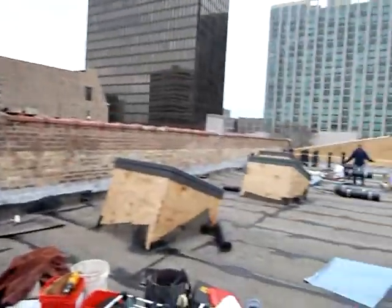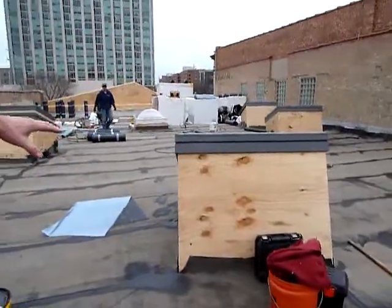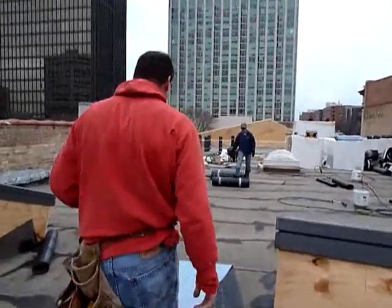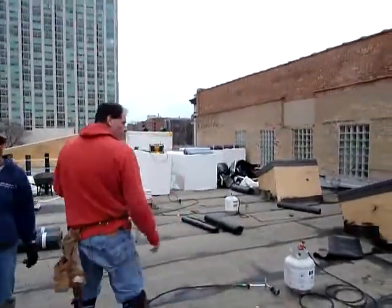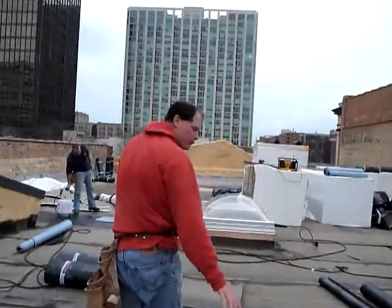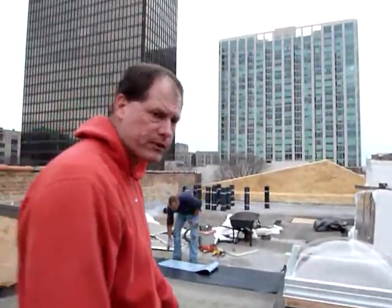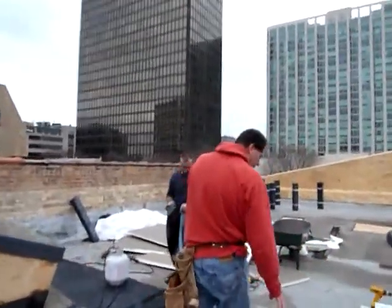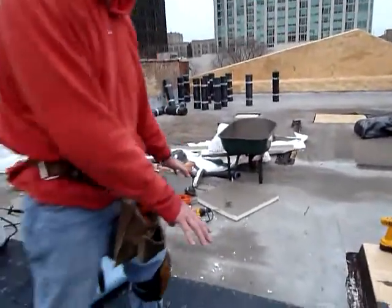Okay, what are we doing over here, Joe? Okay, over here what we've got, you can see the skylights which need to be flashed in with modified bitumen. But if you want to follow me over. What we've got down is 4 inches of polyisocyanurate mechanically fastened to the gypsum deck with the special fastener. And what Bob's doing now, we're doing our cutoff. This is going to be our termination point for today.